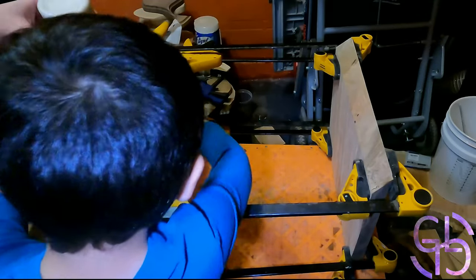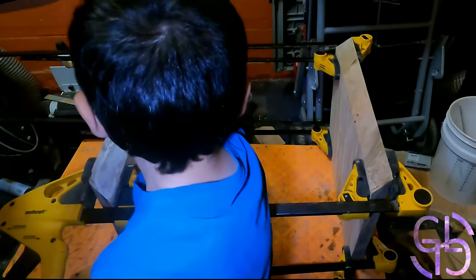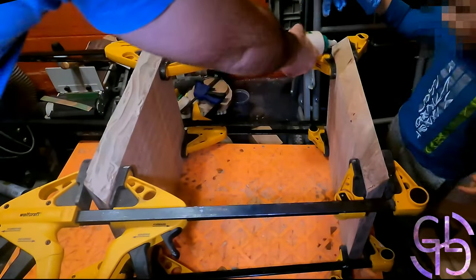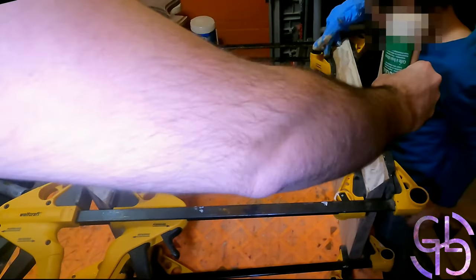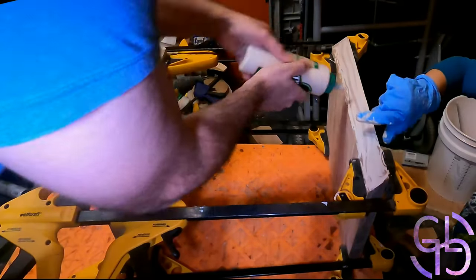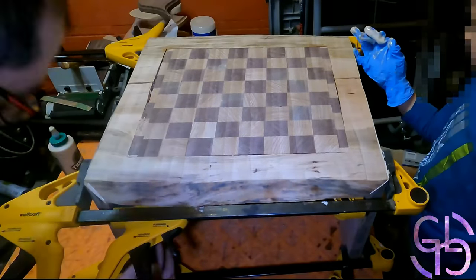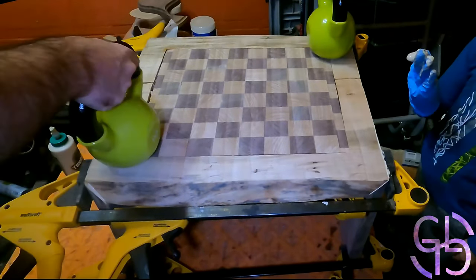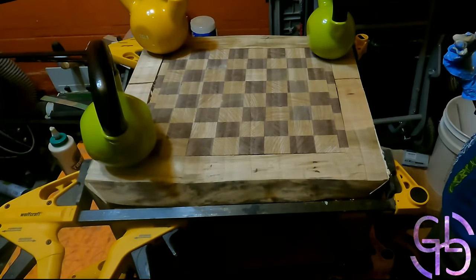Once all three pieces were ready it was time to glue everything up. My original thought was to have the top of the table resting on a bench, then glue the legs and hold them together until the glue set, and slowly rotate the table and let gravity keep everything together while the glue set. My son, however, had another idea — a contraption with clamps where you have a set of clamps pushing out and a set of clamps pushing in. By doing so you ensure that the legs remain motionless in one spot, then you can simply put the table top on top, put some weights on, and let it get glued up. I put about 200 pounds on top of the table to make sure it really pressed down. This worked out way better than what I wanted to do originally and resulted in a very strong bond.